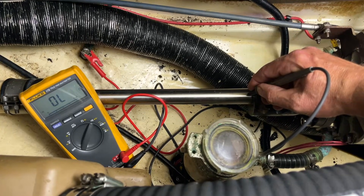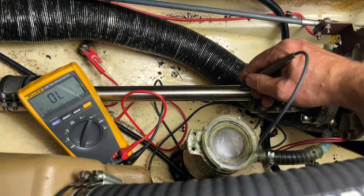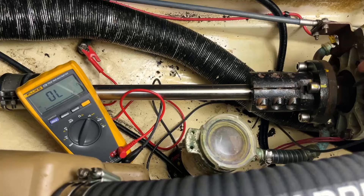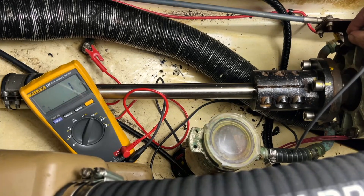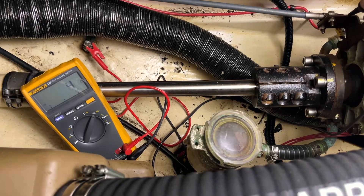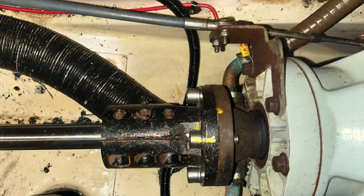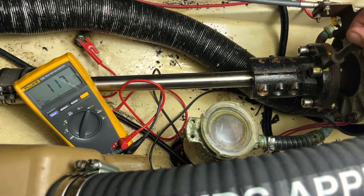So here we are inside the back end of the engine. You can see just above my multimeter the red crocodile clip is on the anode stud, and if I've got the other end here and I press on the prop shaft I get roughly the same reading — about 120 ohms. If I then move back up the train so to speak, this is where the anode wire is connected to — there we go, that's giving me a very good low resistance reading of one ohm on the wire itself. So the wire is coming to the back of the gearbox here, attached to the throttle body plate — that's low resistance — and it goes into here. What you can't quite see down here is the rubber seal between the gearbox output flange and the coupling, and that's rubber, so there's nothing there. So as soon as we get onto the body of the thing we get back to our rough reading of around 120 ohms.